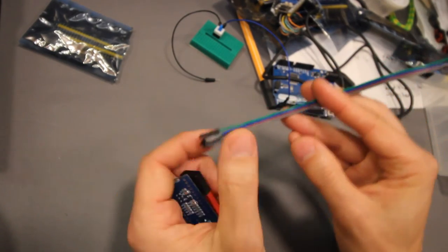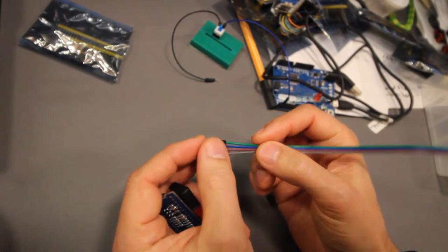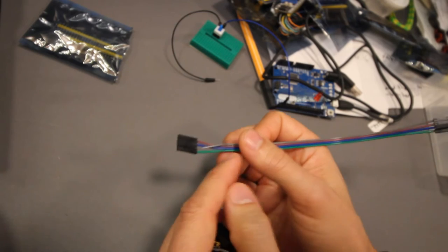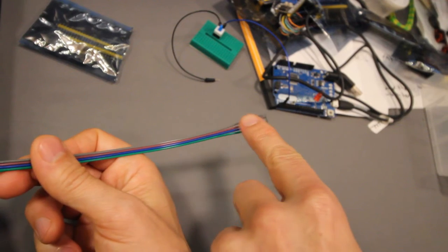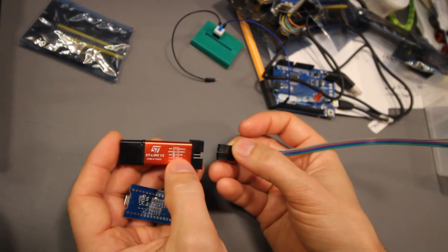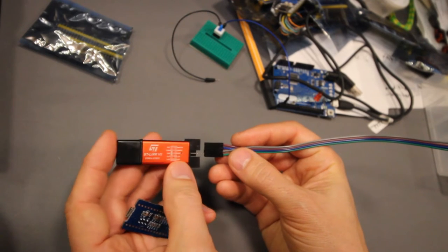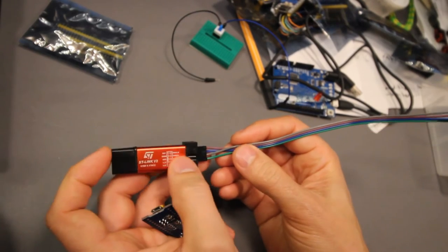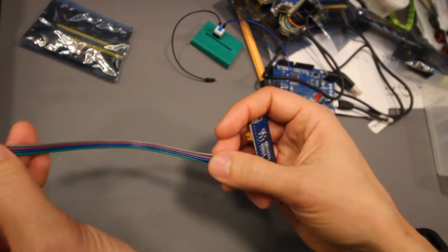So we can do that simply by, on the STM32, using a cable like this, four DuPont cables, and they're all just straight like that. But on the other side, we take the ground cable, the gray one from over here, and we switch that over. So we take that down and close, just beside 3.3 volts. If we put that in like so, we have purple as SW clock.